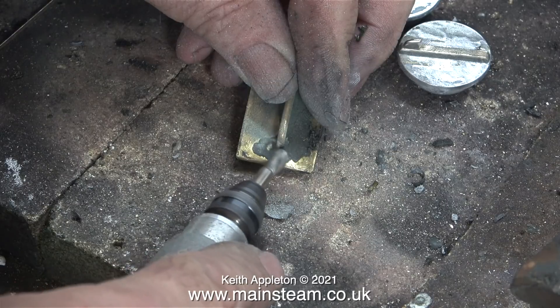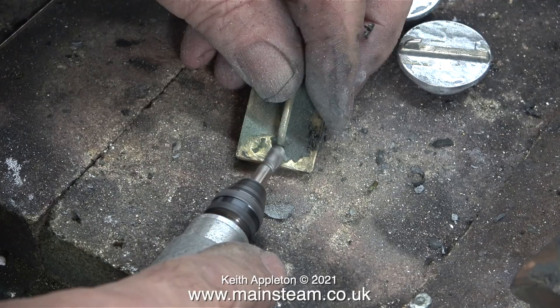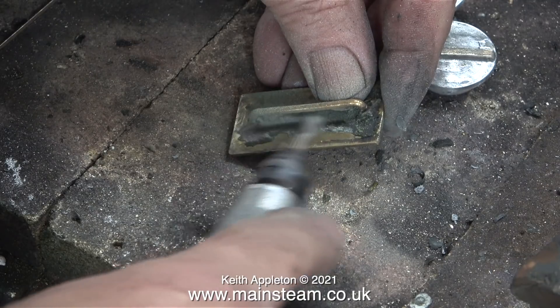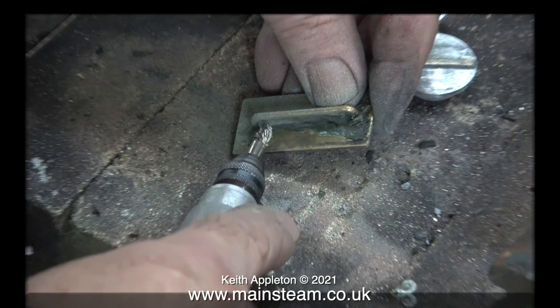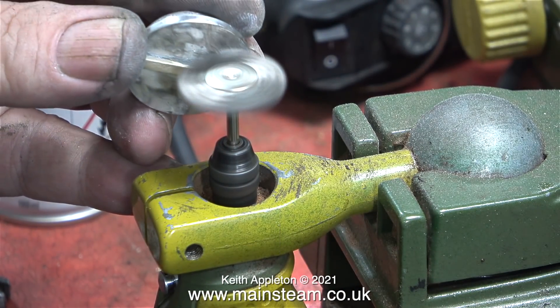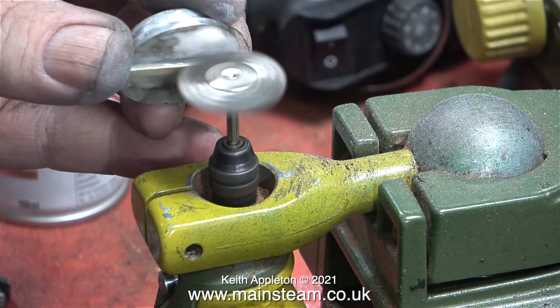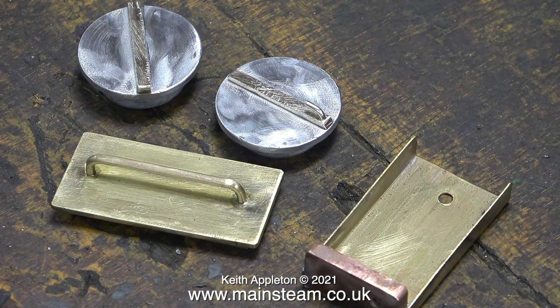This paint was quite well stuck to the part — it's the hatch that fits on the side tank over the water pump. Because the side tanks get quite hot in proximity to the boiler, this paint was quite well baked on, but thanks to the wire brush in the Proxxon motor tool, it soon disappeared. To finish this job, I fitted a wire brush into the bench-mounted Proxxon so I can get right into the corners to remove every speck of paint. Eventually I end up with a kit of parts ready to be repainted, with surfaces scratched up to provide a good key for the paint.